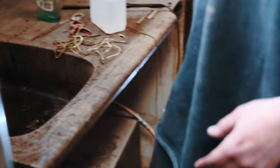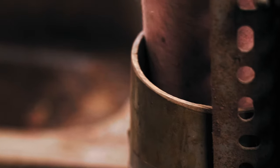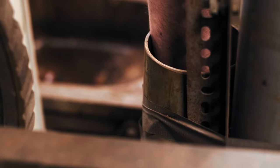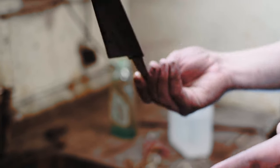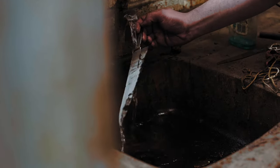We're just going in the etch tank here. I'm going to hold it because I do a very short etch on my stainless clad. I'll just count to 10 and then check — if I've got any fingerprints on it, they'll show up straight away. No fingerprints, nice contrast. I'm going to give it another 10 seconds. I like roughly 20 to 25 seconds in — this is four to one ferric chloride, water to ferric chloride. Then I'm going to rinse it off in some water to get all of the acid off.